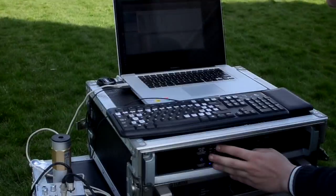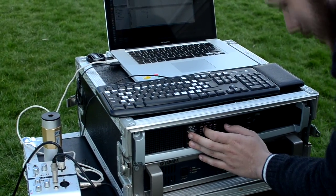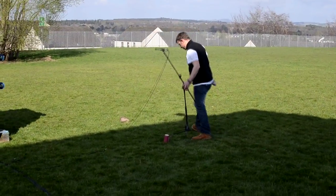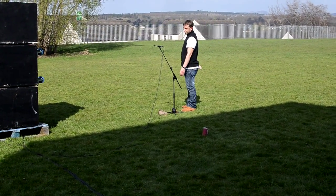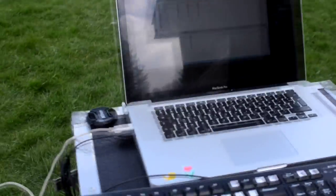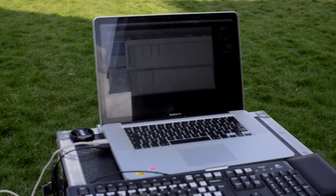22 milliseconds seems to be the sweet spot and we're now going to test at 40, 60, and 80 Hz. At 60 Hz we achieved a 24 dB roll-off with a 13-millisecond delay on the rear speaker. As you can see, it's working at pretty high levels — 110 dB SPL at the front and 86 dB at the back.